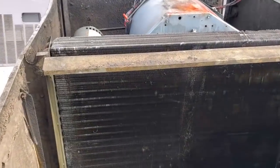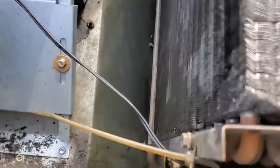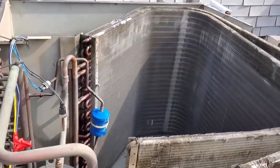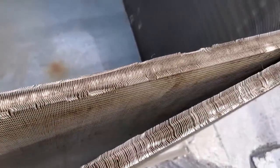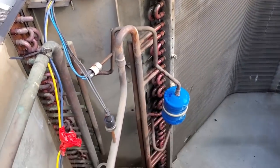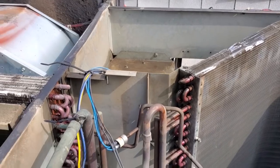The unit's cleaned up as best as possible — much better than it was. We rinsed the evaporator from both sides, got that wire nut out of the drain, so now it's actually draining. We degreased the whole section that had oil on it. We started spraying leak detector fluid but ran out, so we ran to get more. We split and cleaned the condenser since we had the top off. Now we're going to look for the leak. We're picking up a trace with the electronic detector heavily in this area, so we're hitting it with Big Blue soap bubbles to try to find it.